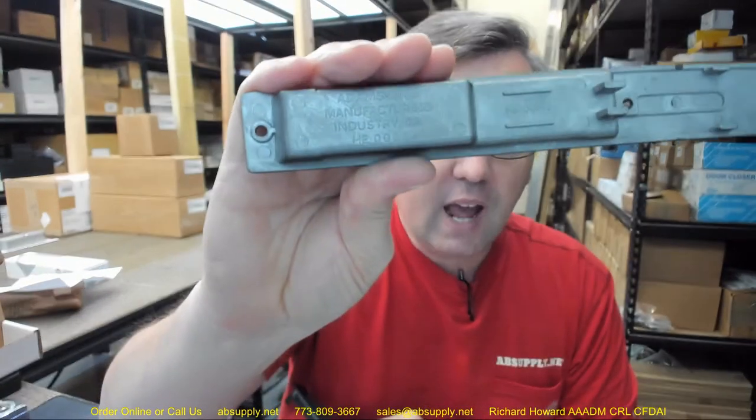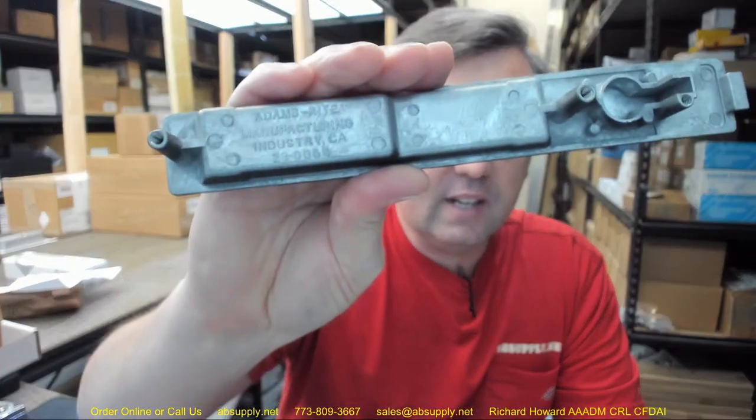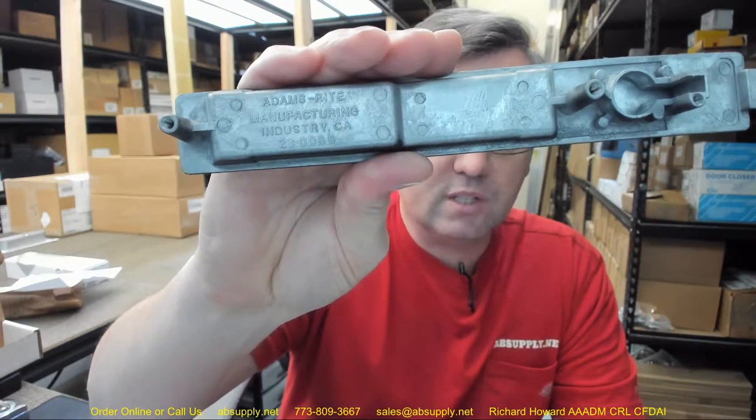Now, it is incredibly common for clients to call us up and say, yeah, I need an HE0066. That's very common for people to say that to us. And then for people to call and say, yeah, I need the 23-066. Now, those numbers are usually never part numbers. They're actual castings, and do not tell us exactly what you need at all. We know what you're talking about when you say HE0066, but we have to translate that into that really long part number so as to be sure to get you all of the parts that you are absolutely in need of for a complete unit.